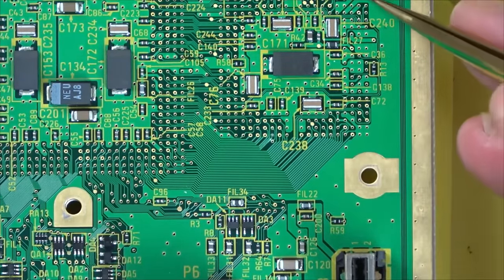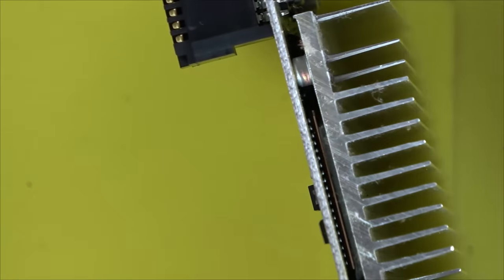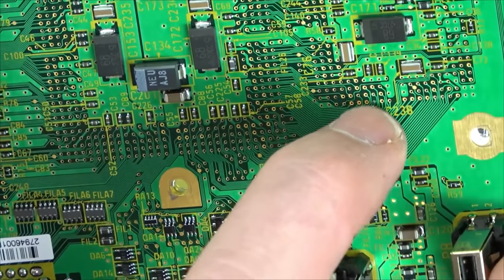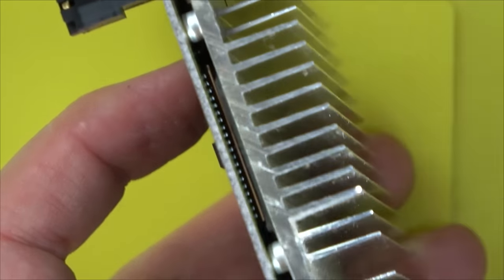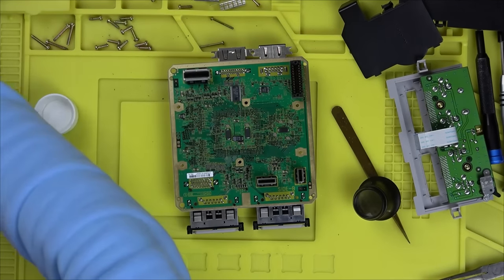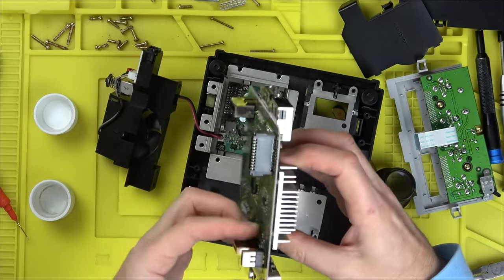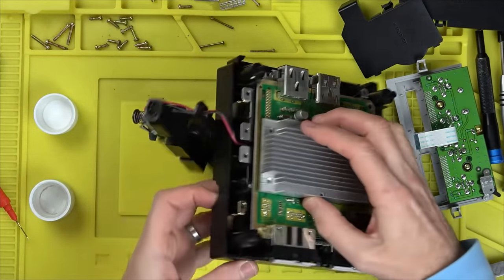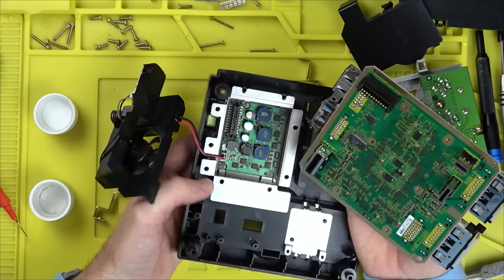You can see the ball grid array underneath all the way across here. There might be a touch of corrosion on the other side — I just think I might be asking for trouble taking this chip off. It's here — let me use my eye loupe and look in there. The balls look very clean, nice and silver. It's very hard to see. I don't know whether the corrosion hit here and seeped underneath or came from this side. The corrosion is here but there are no markings nearby — very bizarre.